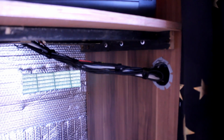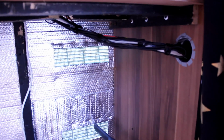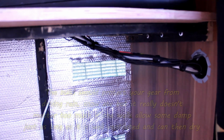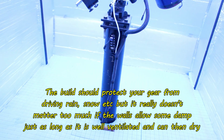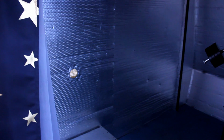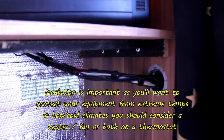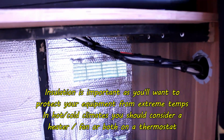And within the insulation, another important thing to factor in, I have made sure that I have maintained some ventilation. Not only will there be a gap around the pier for obvious reasons, but that's in the floor, I've also kept some of the vents in the walls. I have put some extra netting over these to help minimize the spider infestation risk. I don't like spiders.